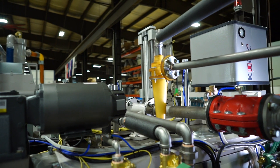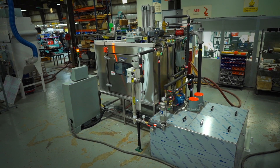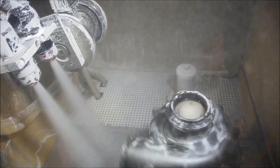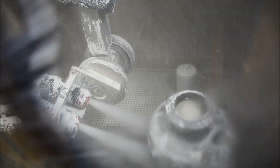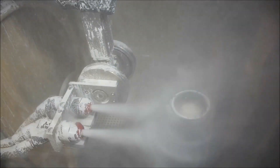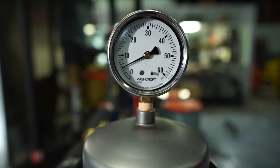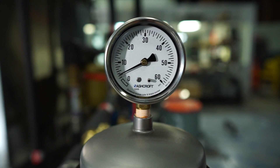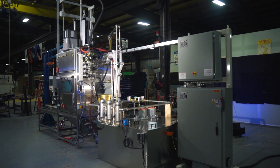The Vaqua Wet Blast speeds up production time and is faster than dry blasting due to greater media flow. The Vaqua's transverse scouring action can produce polishing effects that cannot be achieved through the use of ordinary line-of-sight dry blast surface treatments. Water also helps to prolong the working life of the media, saving money on media consumption. Operators can adjust air pressure to maximize efficiency and performance, as well as to fine-tune the overall surface preparation process.